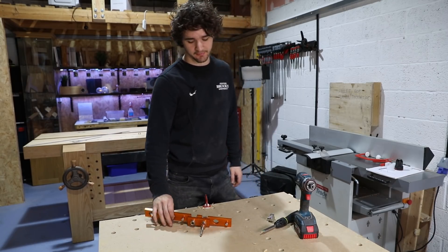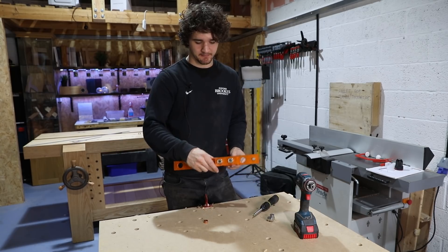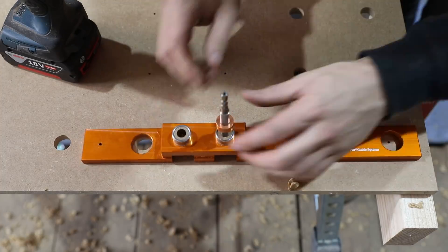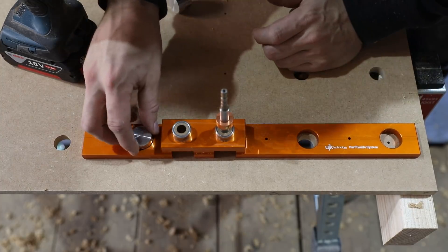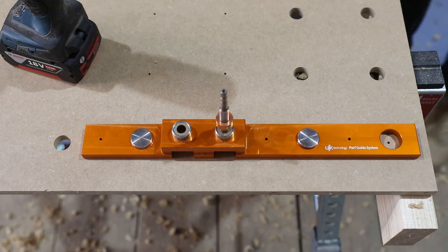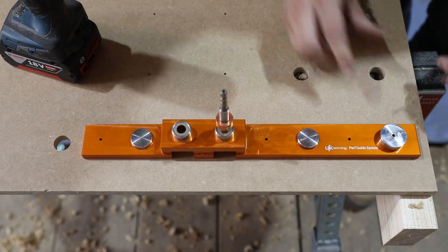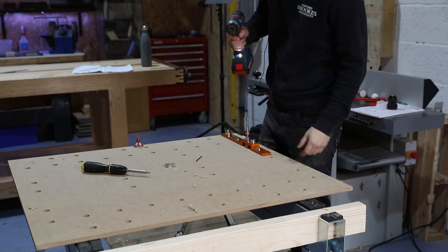So that's all the holes drilled out using the pins and drill bit in the first bushing. Now we take the drill bit out of that bushing and put it into the opposite one, set the depth stop again. Take all these pins out - we don't need those. This is the hole we want to drill now. With the drill bit moved across to the second hole, locate it over there and get that spur in place - you can see these two holes now line up with one of the previously drilled dog holes. Pop the dogs from the kit into the hole below, give it a little push, and lock the jig in place above the hole that hasn't been drilled out yet. In some cases you might be left with a mix of dog holes that line up and ones where you've got the three millimeter hole in the center of a dog hole - for those, you can use your drill guide with either the drill bit or a guide pin to firmly lock it in place.